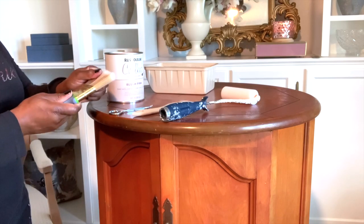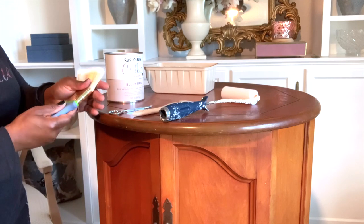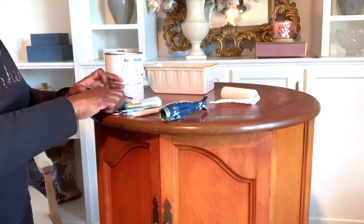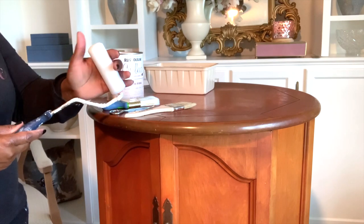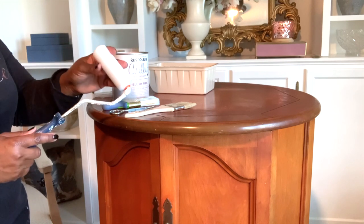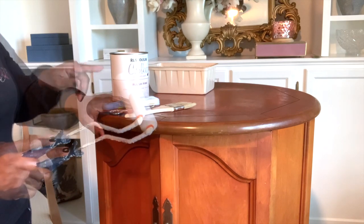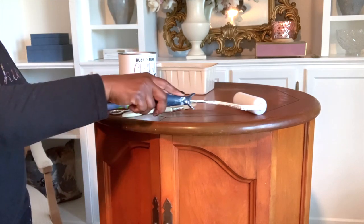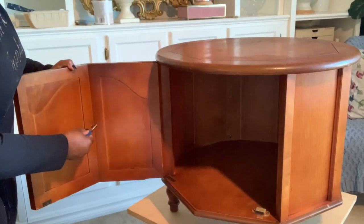Of course I'm going to use a brush — just a regular small brush, like an edging brush. I like the bristles on it; it works very well when using chalk paint. You don't have to get an actual chalk paint brush, just a really good quality brush. And I'm going to use a roller, because with chalk paint you still get a really nice smooth finish. I like to use a regular sponge roller most of the time with chalk paint because it gives a very smooth finish on top of the piece. You will need something to put your paint inside of for the hardware areas.